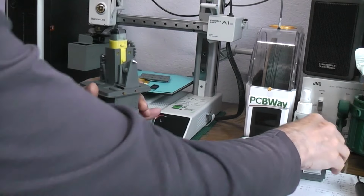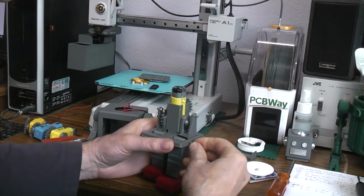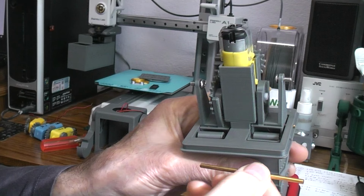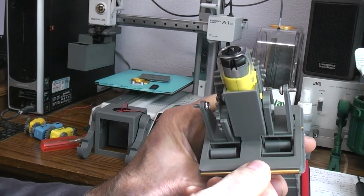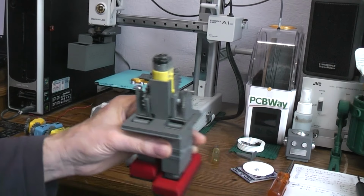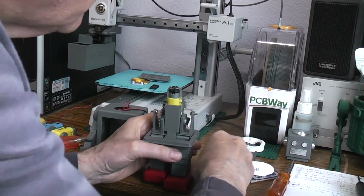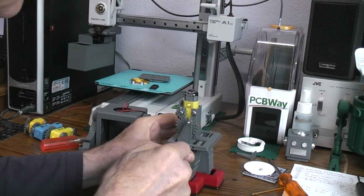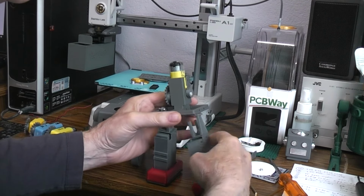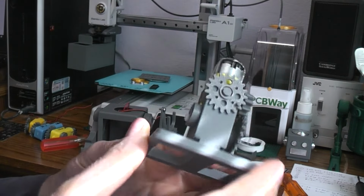So these two rods that I'm pulling out right now are roughly 70 millimeters long. But the point is, this base piece that we're going to strip down to and look at in a second, you want this rod to be able to fit from side to side without sticking out, because the body has to fit down on that. And let's poke that out. Okay, with that out, you can then lift the legs off this whole lower base assembly.